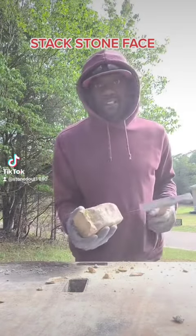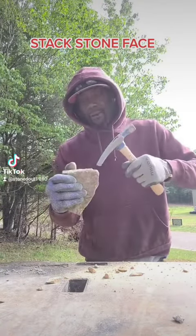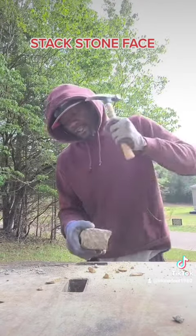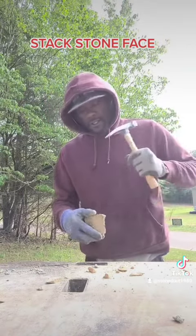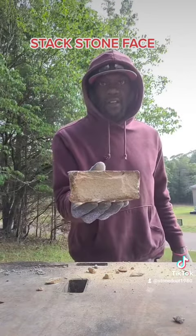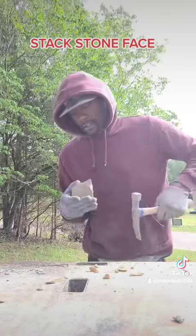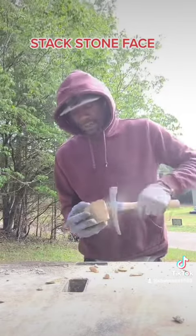When you're pitching, remember, let's do it one more time. See how it looks now? We're gonna take our hammer, we're gonna get us a piece off — like that first. Then we're gonna come this side. You're gonna work it. And that's how you get your look like that on the face of your stack. That's how you stack it — that's how you get the stack stone look on the front of your stone.